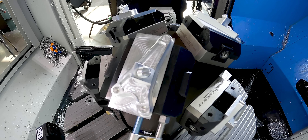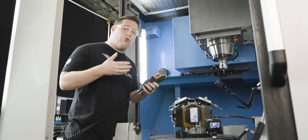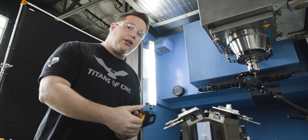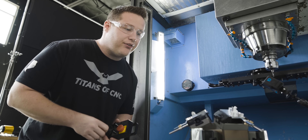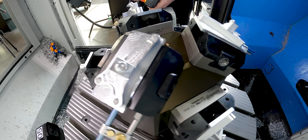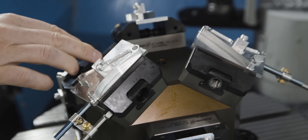I don't care who you are, that was awesome. We just took a four minute cycle time up to 25 minutes by running six parts at a time instead of just one. If you're running production and only running one part at a time, that's going to take forever and waste a whole lot of time. This pyramid running six at a time is a very good way to get utilization out of your machine and keep it running. I'm really loving the design of this fixture — even though we're running six parts in a very compact design, the low profile KSC Mini is allowing us to have a lot of clearance and it's really not too tall for our machine. The angle that the vices are on gives us plenty of clearance between each part.